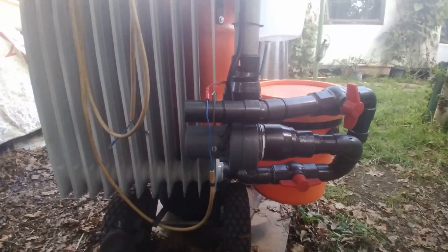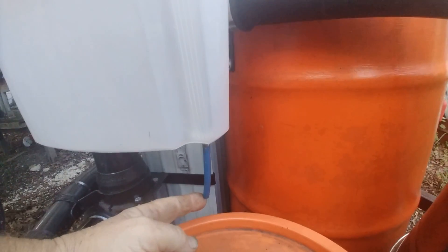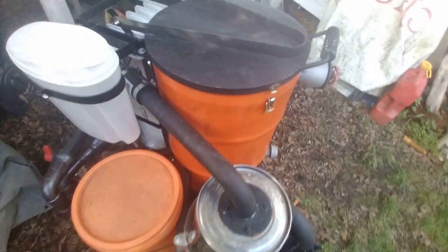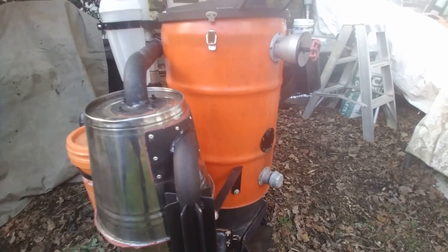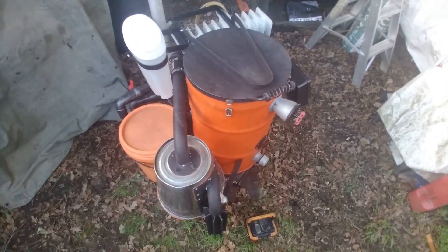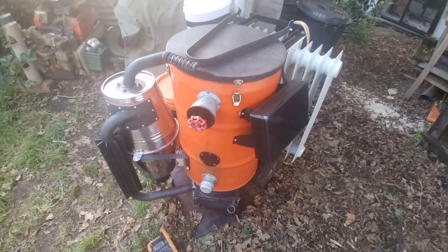One thing I haven't explained in any of the videos so far is what's with the water container. The water container will have a drip tap on the bottom, and from there copper pipe runs down into the center of the burner so that two drips of water per second can be delivered. The addition of water at two drips a second encourages more hydrogen gas into the mixture — because the wood gas mixture is carbon dioxide, methane, and carbon monoxide. By adding the water, we're adding hydrogen to that mix as well.